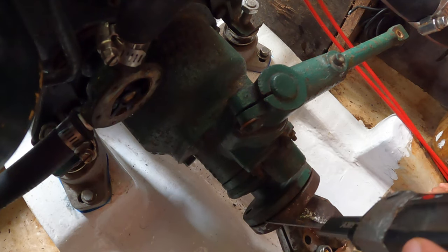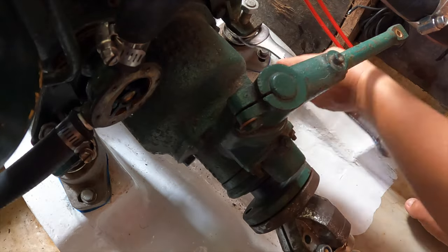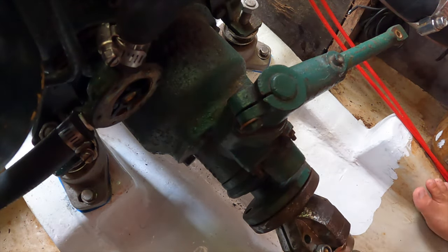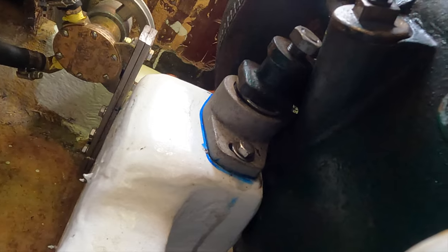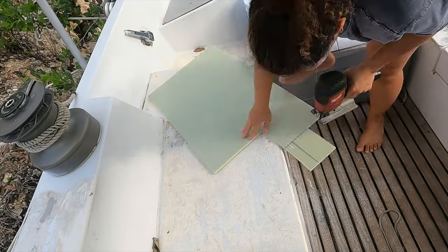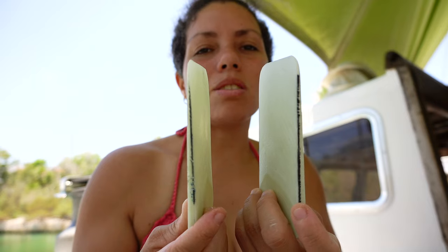I was still waiting to get my hands on some proper feeler gauges to measure the adjustments, but I could already tell that something was amiss. No amount of moving the back mounts up or down was allowing the faces of the couplers to line up. The front of the engine would need to move upwards. However, the studs of the front feet were not long enough to allow for this type of movement. With some G10 wedges, I hoped that we could incrementally bring the height at the front of the engine up, so I tried my best to shave these pieces of G10 down into wedges to place under the feet of the engine.